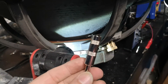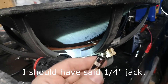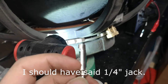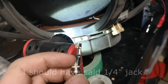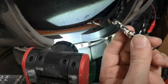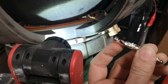This is the quarter-inch cable I'm talking about. I'm going to open this up. I'm going to take this piece right here — I'm going to cut that out of the quarter-inch cable. I'm going to rework it a little bit with pliers, straighten it out and cut it up a little bit. Then I'm going to clamp this piece onto the wire, and then solder this piece onto the copper. I'm going to give that a shot and show you what I come up with.